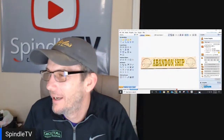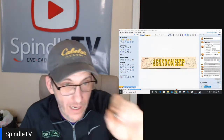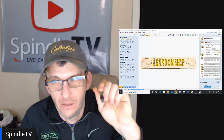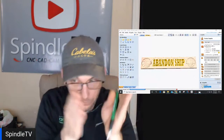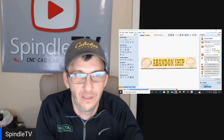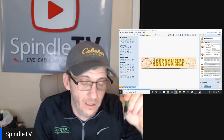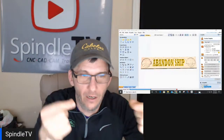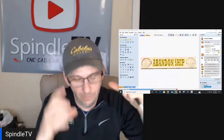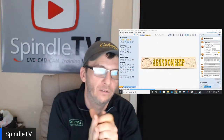And then Mike jumps in and says, could you create a profile toolpath around the letters to create that little pinstripe? If I were to use a round end mill to create a little channel there for a profile, I still have to fill it with another inlay, but I'm going to have rounded inside and outside corners because it's a rounded bit. I could do a V-carve profile, but then I'm going to have to create a little V-carve inlay to go around there. And this kind of just makes my inlay much more solid. It's 0.3 inches deep. It's a solid inlay, and I don't have to worry about glue gaps or anything like that.